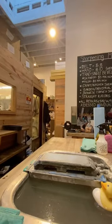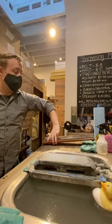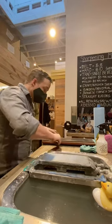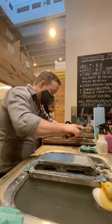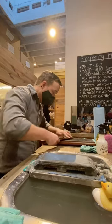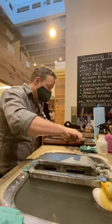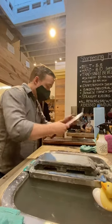This is a leather strop loaded with a 1 micron diamond abrasive. Now, stropping is definitely augmenting the edge that I produced on the stone, but it's also a bit of a diagnostic tool. I can see if I have a micro burr left on there that I need to go back to the stones to remove, but this one went nice and smooth.